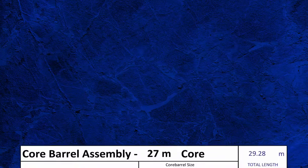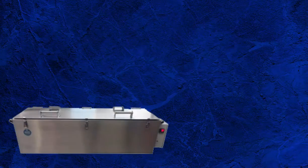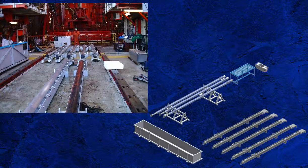Once the equipment has been checked, a BHA should be produced reflecting the tool to go below the rotary table, remembering to advise the drill crew to drift the pipe. The core handling equipment should be tested — items such as wax baths, saw units, gamma loggers, and so on — to ensure they are working efficiently. The deck should be assessed for the most appropriate space to lay out the core processing area, ensuring adequate space and minimum exposure to HSE risks.